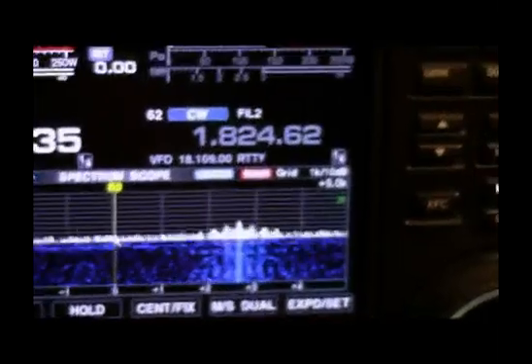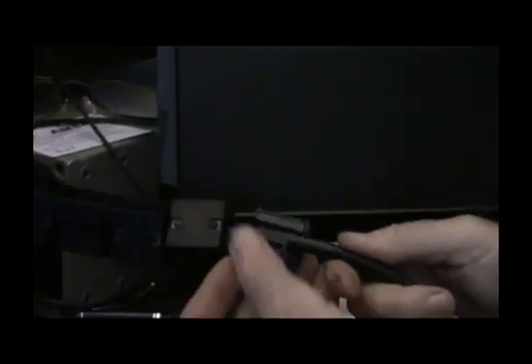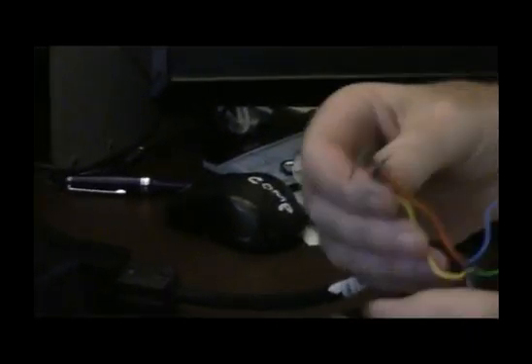Noise can come from everywhere. I've got a lot of noises to get rid of here before I can hear really well on 160. So what I decided to do — I had some old clip-on toroids — I started clipping toroids on, and after I put a few on I touched the contacts the same way and the noise was gone. I put a bunch of toroids on here; I had some clip-ons. I put a small one on each end so they wouldn't slide around. Now when I touch that wire to the same place, the noise is gone.